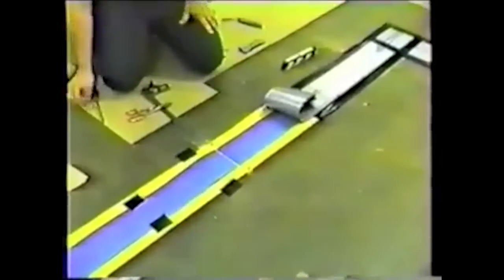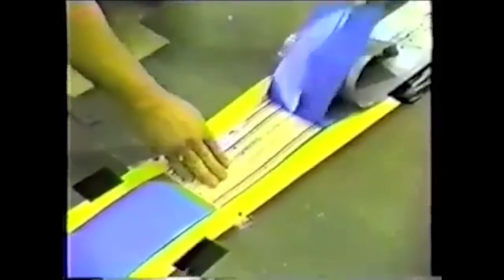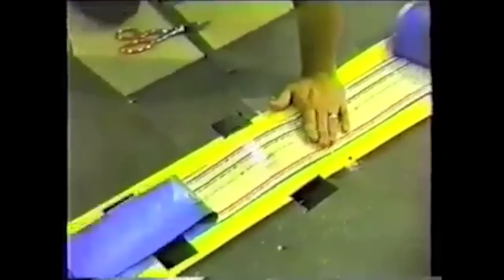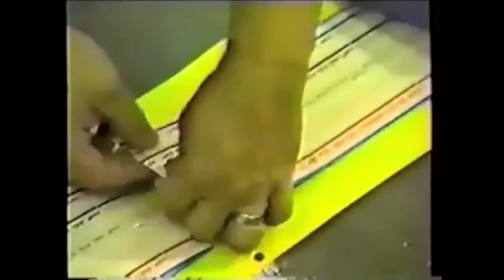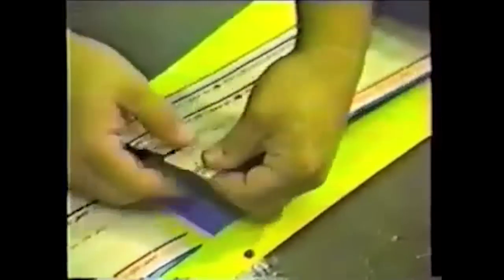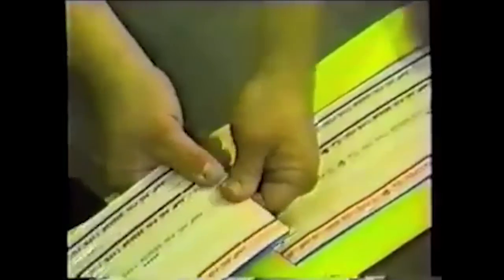After the floor fitting base plate has been removed and the new vinyl floor preparation, if required, and all the new floor fitting base plates have been installed, install the new extended length of cable to within 1/8 inch of the installed cable. Pull back the top protective blue vinyl on the existing and extended cables approximately 9 inches. Separate the conductors along the perforations on both cables for a length of 2 inches.